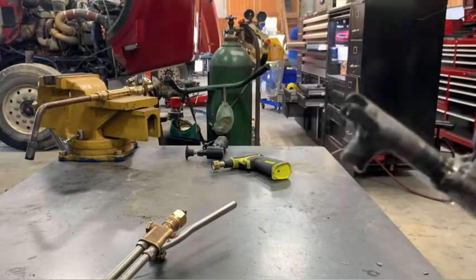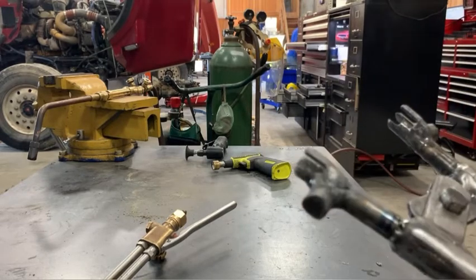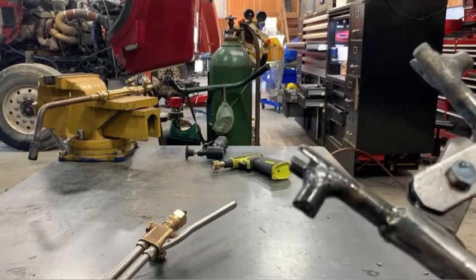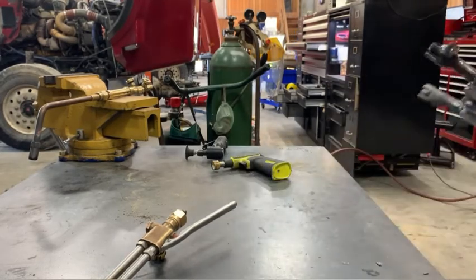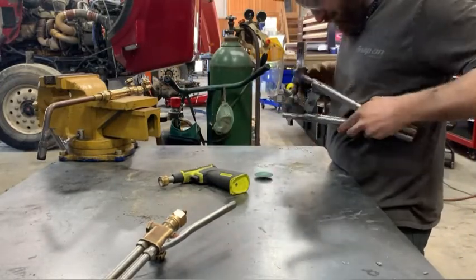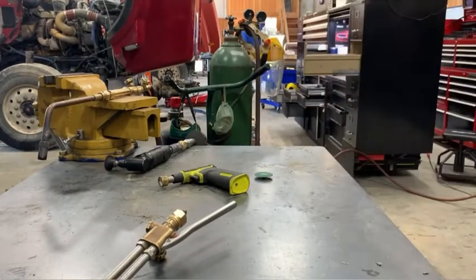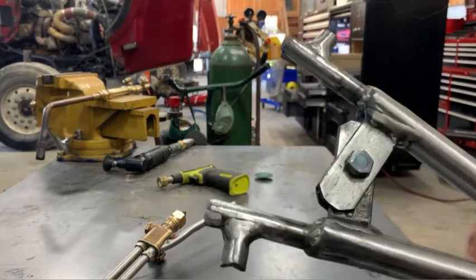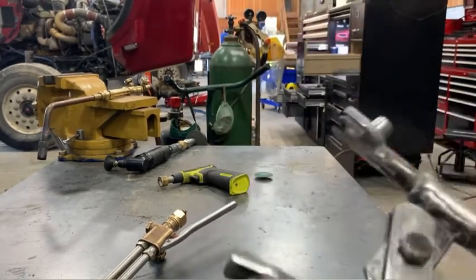Now that's the first step in hardening it. Now it's very hard - you want to be very gentle with it because if you bump it just a little too hard it will snap off. The next step is to heat it up to about 600 degrees and actually soften it a little bit so it's not brittle. To do that you just polish this off to basically a mirror finish, then heat it until it turns like a rich purple, almost blue, and then quench it a second time. You just want to shine it up enough so you can see the color change at different points on the material.